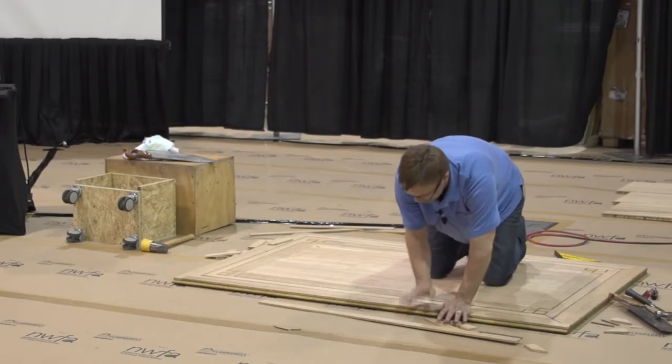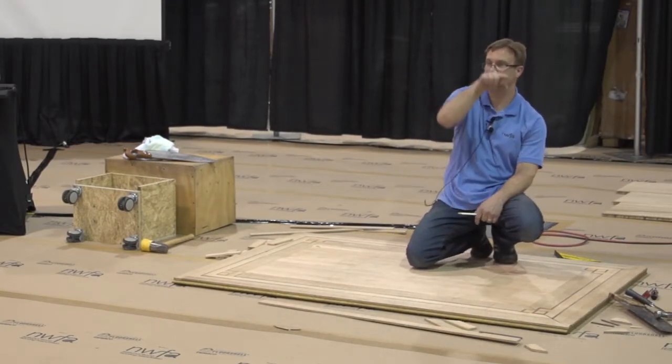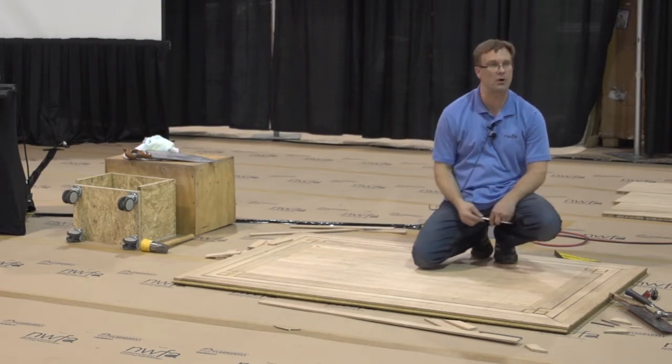There are a lot of different types of flooring we used to do with 5/16s. We used to do something called ship deck, which was three fives and sevens. We used to border each one of those planks with walnut, put walnut plugs on the ends, and bow ties on the seven-inch planks. Very attractive floors — they used to love doing those.